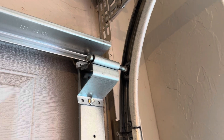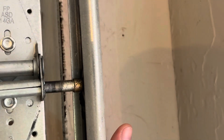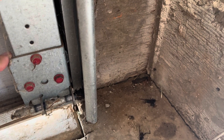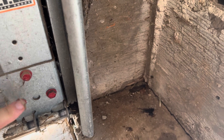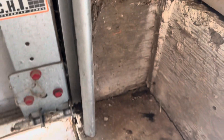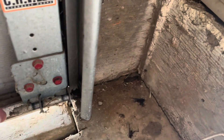You have the same lift cable right here. This lift cable runs all the way down and is attached to your bottom bracket — that's where all the weight is on that cable. You don't want to remove this because it will pop that cable up like crazy. Bottom bracket with a roller.